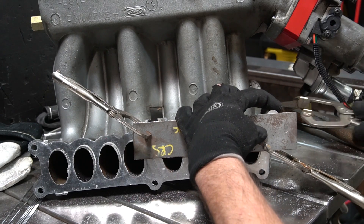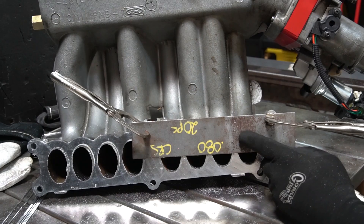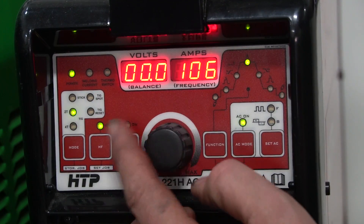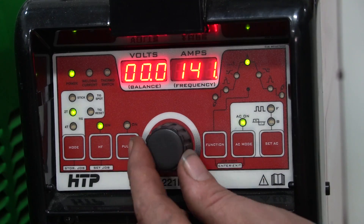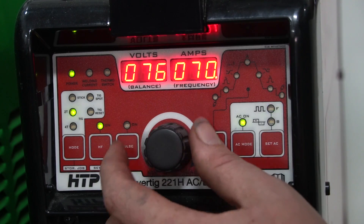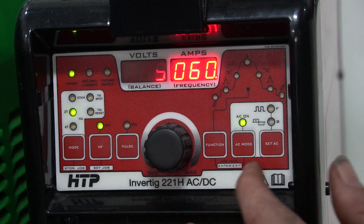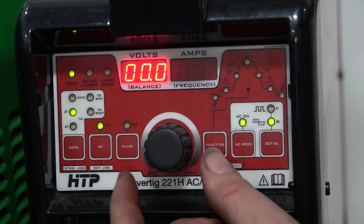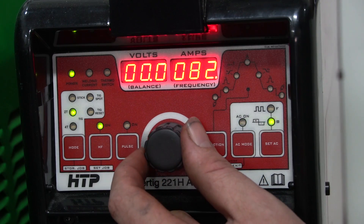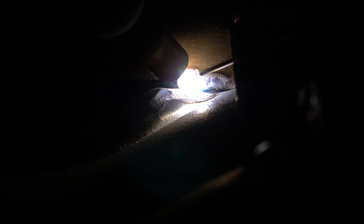After I get it clamped on there, I'm going to grab a soft hammer and give it a couple of taps. This is just going to make sure that if it was off slightly, it will actually lock itself back in place. Now let's talk machine settings. I'm running my Invertig 221 from HTP. My frequency I'm going to drop down to about 60 hertz — normally I run heavier casts somewhere around 30 to 40 hertz because I want more time spent on each end of it. I'm going to set my balance to 65. On the HTP Invertig 221 I have independent amplitude control of each side of the wave. I'm going to drop my negative wave down to 80 percent of the power, which means I'm going to spend more time on the cleaning side and not too much on the negative side where it's going to start breaking up all kinds of junk. It's literally just going to create a nice little surface to run with.